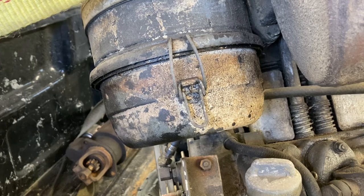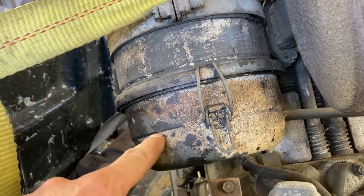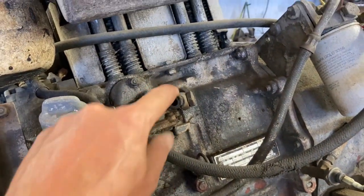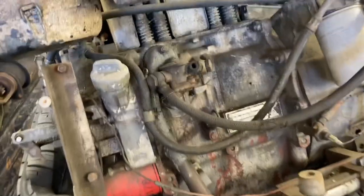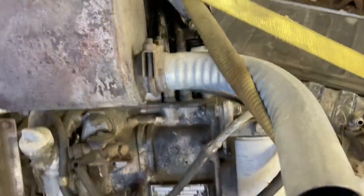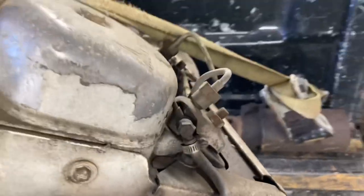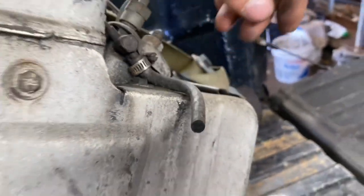It has an oil bath-style intake. You take these off. There's oil in here that's filled to this line. See the lift pump here. We're gonna have to put some fuel in that hose right there. We'll have some type of fuel source, probably just a bottle. It does have a return line right here inside the injector. It's packed with mud, probably from a mud wasp.